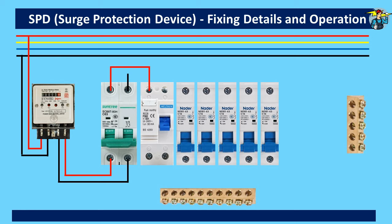Some have doubt on which side of the main switch should get the lines first from the meter. Normally three-phase main switches show on their side where the load and the line should be connected, but not on some single-phase switches. However, most single-phase switches show an arrow mark pointing down with numbers one, two, three, four marked starting from the top, making it clear that main line terminals are on top.